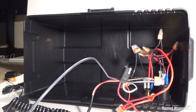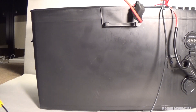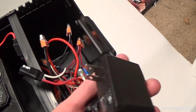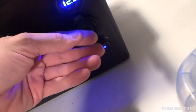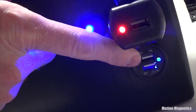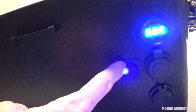I used the battery spacer to tuck all the wires away from the battery, dropped the battery into place, and tucked the solar and electrical charger cords in. The ring terminals are bolted to the battery with a washer so that the small bolts don't slip out. The power box lit right up with the flip of a switch, so I'm confident that I wired everything correctly. The voltmeter shows the voltage and the USB ports light right up.